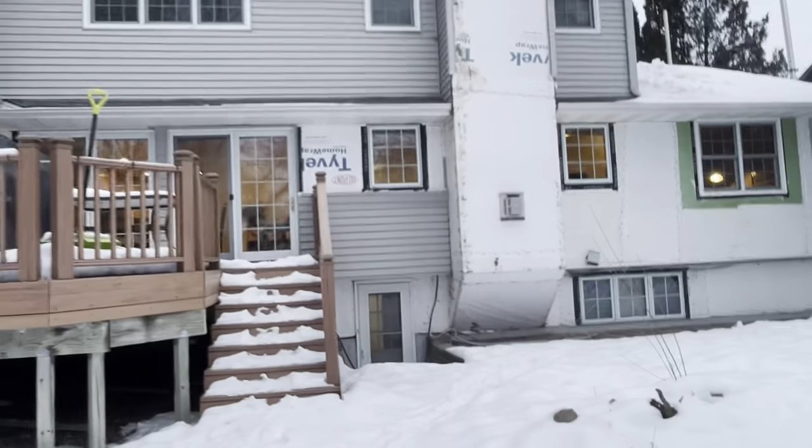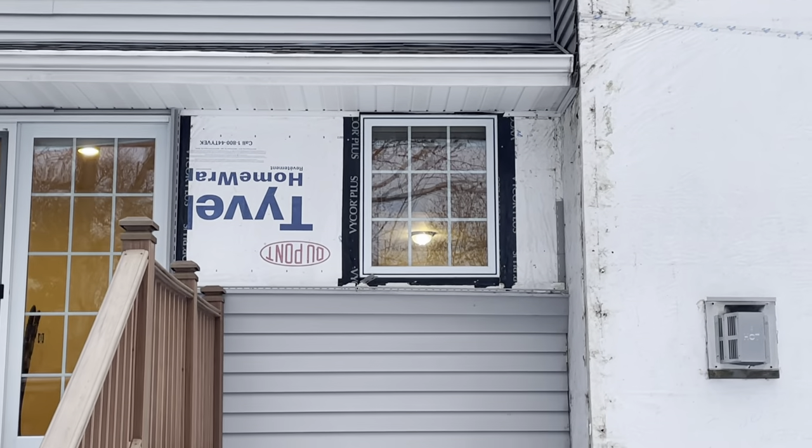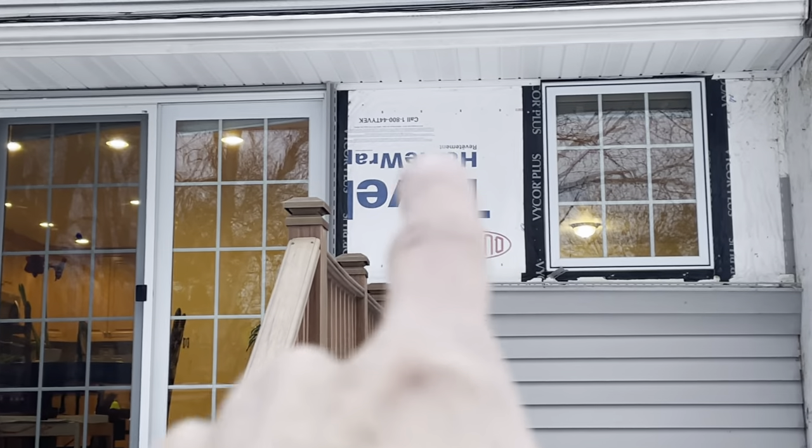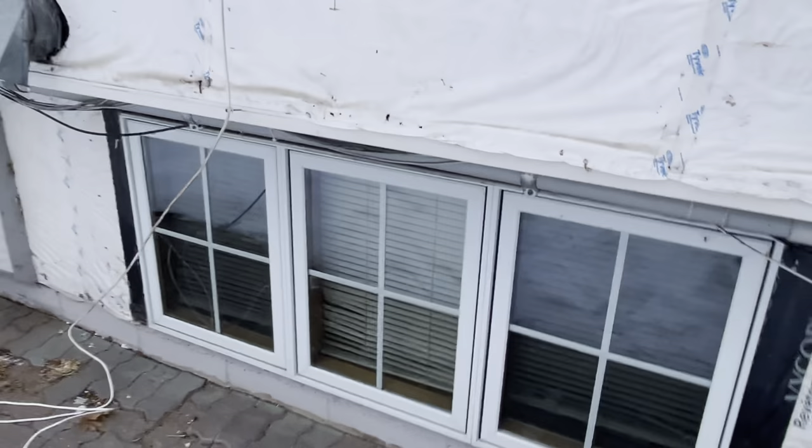Around the windows you can see a few different things - there's moldable tape that goes around the window; you've got to have flashing tape. You can see some of the old moisture wrap - Tyvek. Tyvek always gets taped at the seams. Here's some of the pre-existing Tyvek or non-brand moisture wrap - it always gets taped at the seams, and anywhere you have a corner they wrap the Tyvek around four inches and tape it. Otherwise on the wall they'll typically overlap by about two inches and then tape.